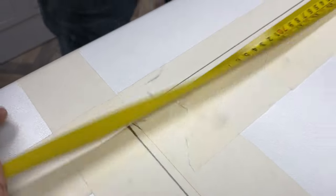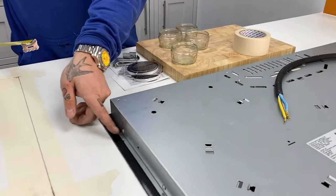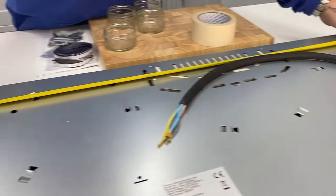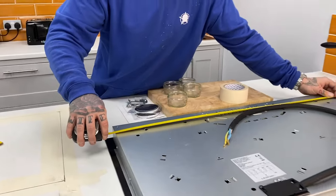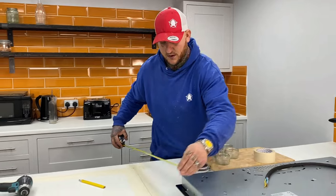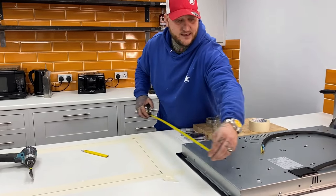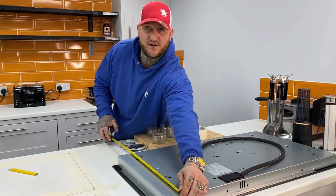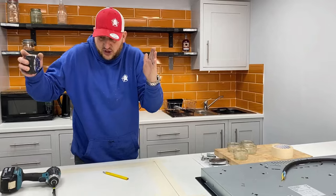The gap in between measures 860mm. When you transfer that, bear in mind you need to measure the top and account for the screws — you're looking at about 852mm, so 860mm gives you a little wiggle room. For the depth I've got 490mm, so coming from the top at 485mm gives you about 5mm of tolerance to allow for the screws as the hob slides in.